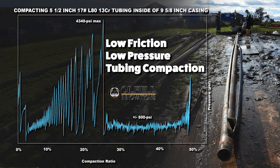Regarding prediction, this is an actual pump pressure graph for the compaction you see on the right. The maximum pressure was 4,340 psi when the spear was trying to find the split in the target tubing, after which the pressure dropped to approximately 500 psi when the spear was traversing within the two halves of the target tubing. Upon finding the end of the split in the target tubing, the pressure began to increase, and we stopped the simulation so that we wouldn't damage the seals on our cement wiper plug.